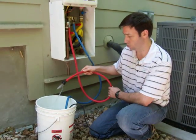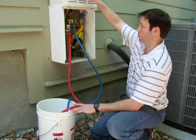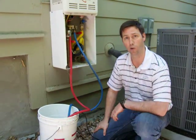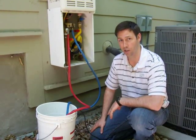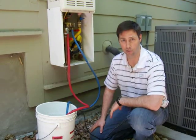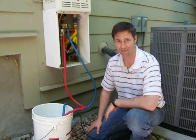The manufacturer recommends you do this for 45 minutes. That white vinegar is going to remove all the scaling happening in this tankless water heater. Thanks for joining me — give it a shot. I think you'll find that it's actually not too hard and it should really give a full life out of this tankless water heater.